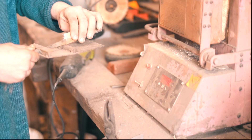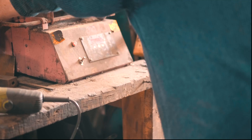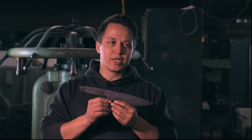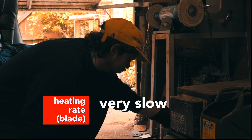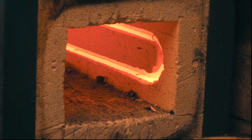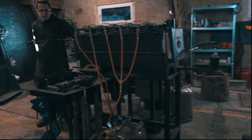The heat-up rate of the metal while it is in the kiln is not an issue in terms of time for you as a maker, but it is typically a time that will affect how fine your grain structure will be. Most important is precision — if you overheat the steel, no matter what the heating rate is, the grain size will be larger. However, if you hit the same temperature, a higher heating rate will result in a finer grain structure. The heating rate of the metal in an electric kiln is pretty low — it's the lowest of the different methods we looked at, simply because we only have radiation. There's no convection, no direct heat input. The glowing hot walls transfer heat to the knife via radiation, and while radiation is a very powerful means of heat transport, it only starts becoming efficient in the 800 degrees Celsius range. A stainless steel blade might actually heat up faster because it's heat treated at around 1100 degrees, where radiation is a lot stronger. In the 800-degree range, radiation is still pretty weak.